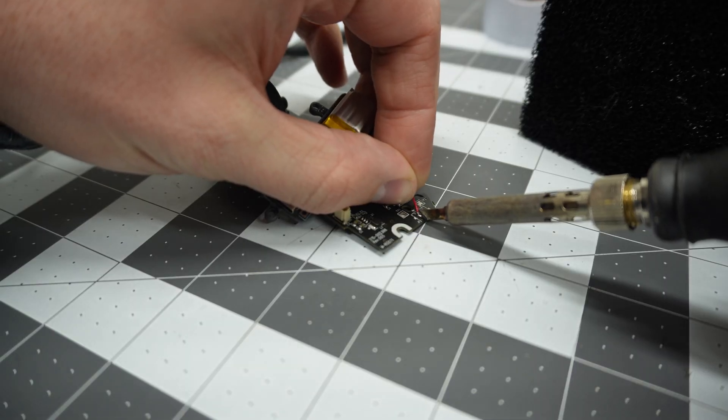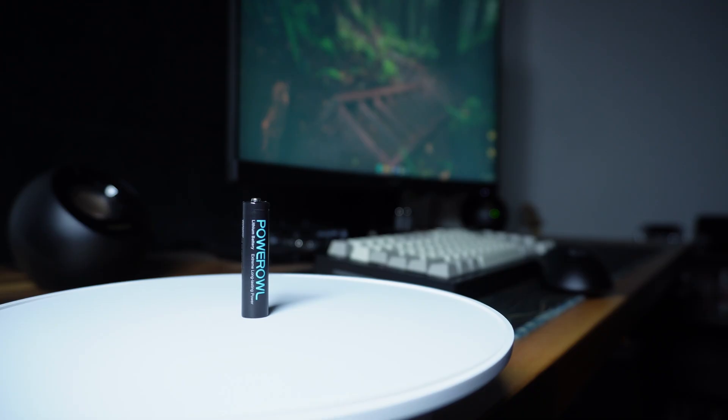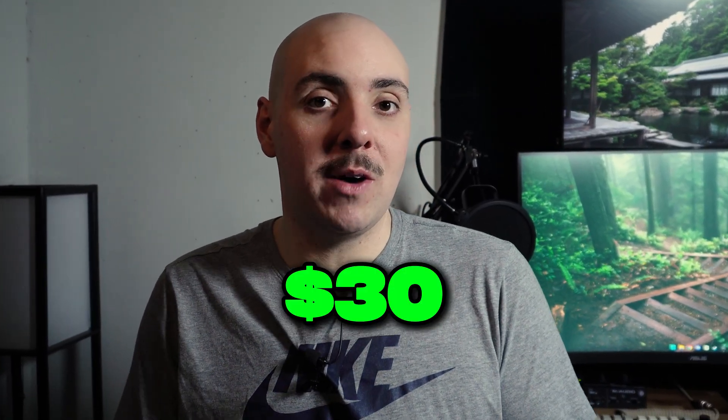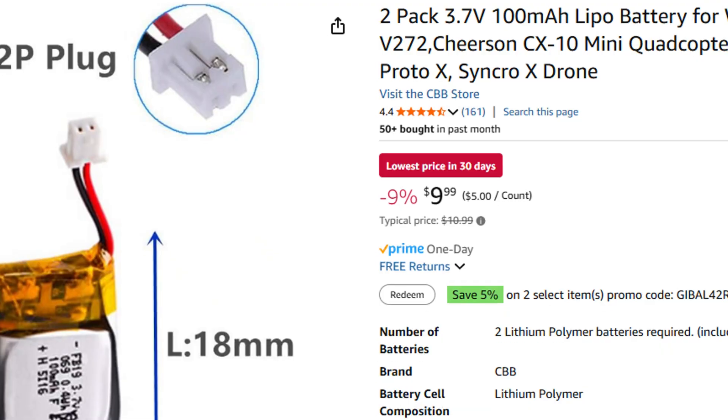Here's the best part: if you still want to build this mouse but you don't know how to solder, or you just don't want to spend the extra money on the new battery setup, you can still use the original battery sled from the first version with a lightweight lithium AAA battery — I even upgraded the sled to make it a little bit lighter. Meaning this mouse can still be built for just the price of the G305. Just keep in mind it obviously won't be as light with the AAA battery. If you do want to use the new LiPo setup, I'll leave Amazon affiliate links in the description for all the necessary parts — it only costs about an extra $16 for the BMS and battery.